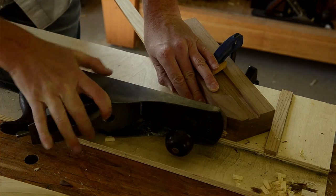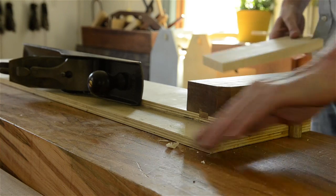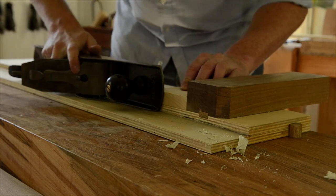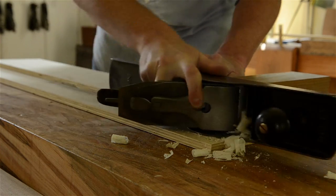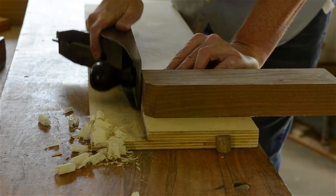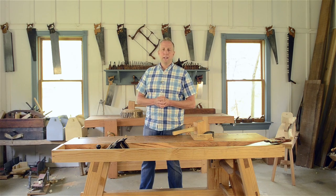A shooting board is used to square and miter the end grain on your workpieces, like on picture framing. It can also be used to square edges of boards. It should definitely be made in your workshop, although there are some pretty cool antique metal shooting boards. The hand plane lays on its side and is pushed along the base to remove a little bit of wood at a time — like shaving — until your piece is square or mitered. There are probably thousands of shooting board designs and tutorials in books and online, so you shouldn't have any trouble finding a free plan that you like. I share a few designs in my article that I personally think are cool.